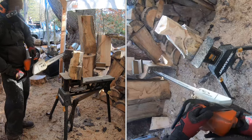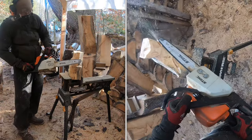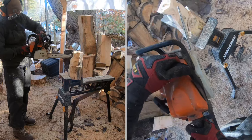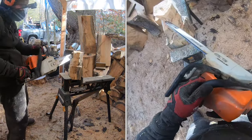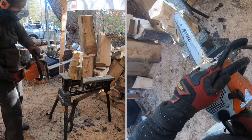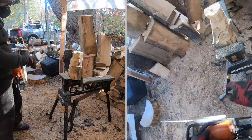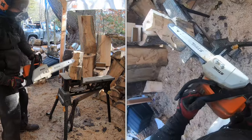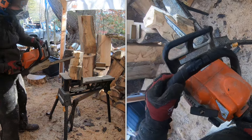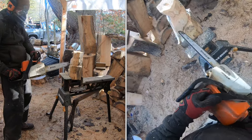We are carving pine, and I gave the rough dimensions in the beginning of the video. Right now I'm looking at this piece thinking about how to separate the head, neck, body, and wing area. We're making little cuts here — saying okay, this is where the beak's gonna fall, let's come in underneath, remove some material with a scraping motion. A little line, a little line. Now we've sort of defined where the head is sitting — it's not gonna have like a ton of neck. Now we're going to go ahead and cut a line in just a little bit for this wing, trying to keep things rounded as we go.